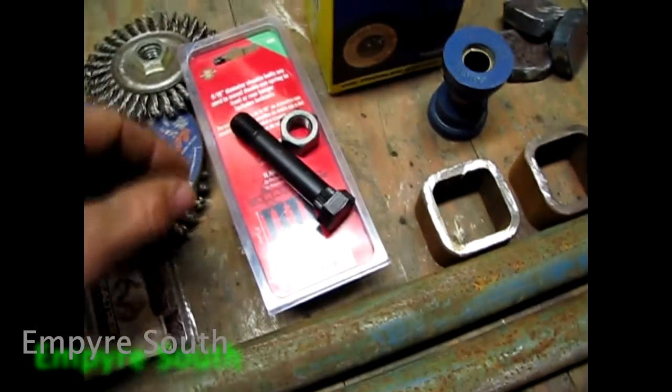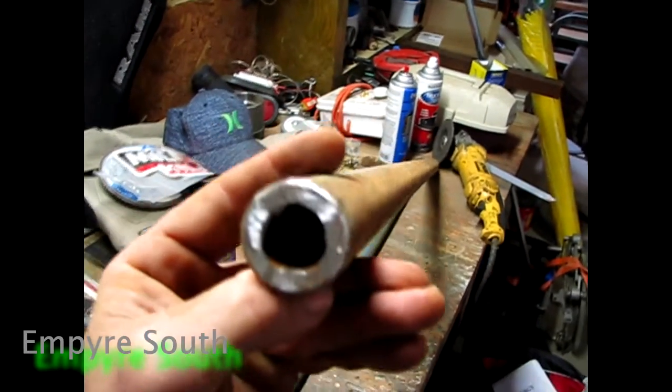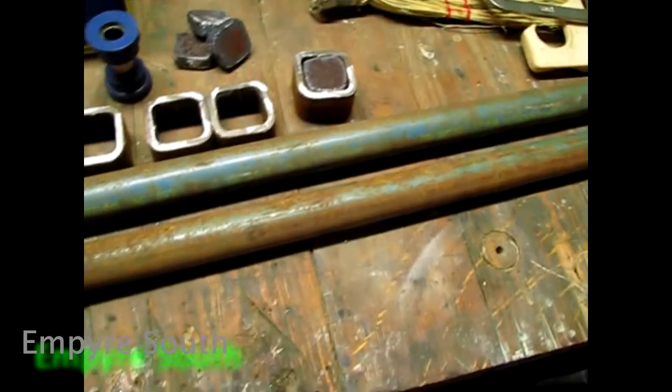Here's all the parts you're going to need. What I did for the actual ladder bar piece, I found some one inch schedule 160 pipe. You see how thick that is. Now this is not some Home Depot thin thread pipe — this is well quality stuff, y'all. It's real hard. So anyway, for the actual ladder bar: one inch schedule 160.